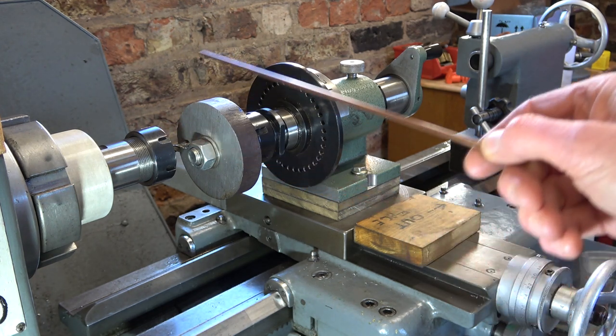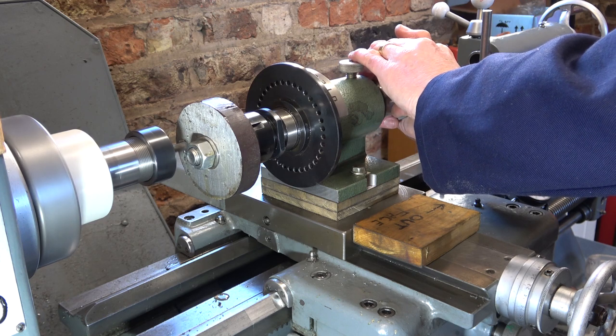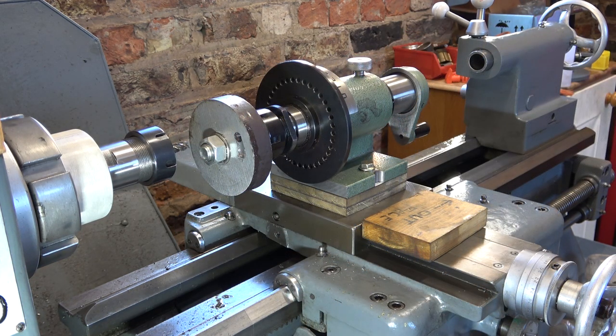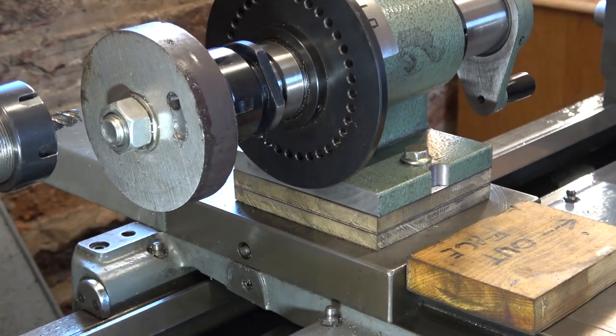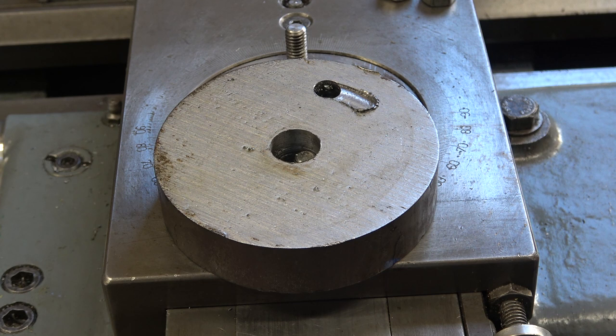The way this works out I can cut to half the depth, so when I get halfway I'll have to turn it round. Well, it's technically possible but just impractical. You can see I've managed to start cutting that circle, but it's taking too long and it's a very cheap cutter — one of those eBay sets of six or eight for about twelve quid. The cutter's just not cutting as well as it was when I first started. I think if that was nylon or cheese it would be fine. I'm going to have to machine out the middle. I did say it might not work but it was worth the experiment — you can see how metal was building up in front of the cutter. Maybe one of you can leave a comment and suggest what I was getting wrong. Anyway, we'll go back to the traditional way and just bore the middle out.